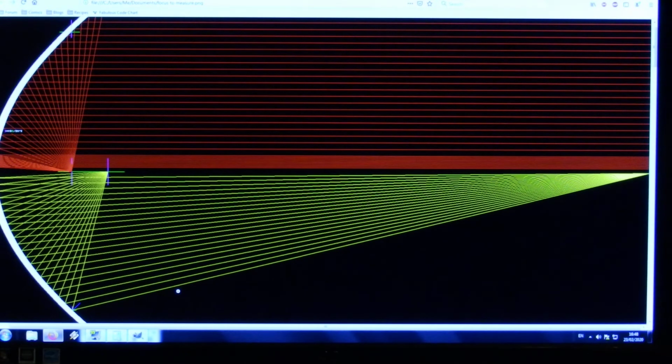If your magnifying glass behind it has a primary focal length, which is, in the case of a magnifying glass lens here, light from infinite distance focuses to there, that's your primary focal length. If you have a 10mm primary focus and your incredibly good magnifying glass at the back, and a 2-metre primary focus on this big reflector, meaning from there to there is 2 meters. So there is a 100-to-1 ratio, sorry, there is a 200-to-1 ratio, you'll get 200 times magnification, which is pretty good. You get that all the way up to, say, 600, you can lip read 2 miles away. Wonderful.